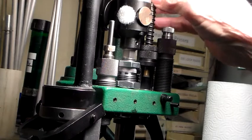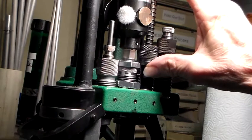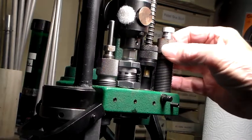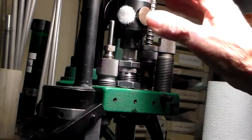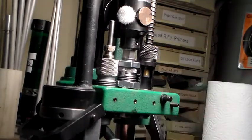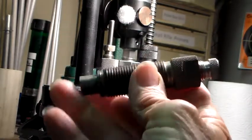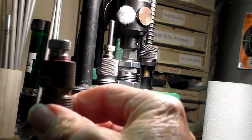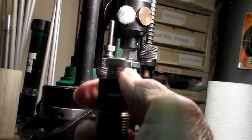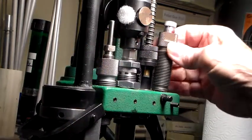This die is what I like to use for my final crimp. I use this station only to start my bullet. You can do it the conventional way if you want, but it puts a lot of pressure on this seating unit — that's why people consider this to be the weakest link in the whole machine. If you use this third station just to start the bullet into the case mouth — push it in an eighth or a quarter of an inch — and then use this die to both crimp it and do the final seating, you'll probably never break one. Many different companies make it; this is a Hornady, and it does both the taper crimp and the final seating by adjusting the top adjustment.